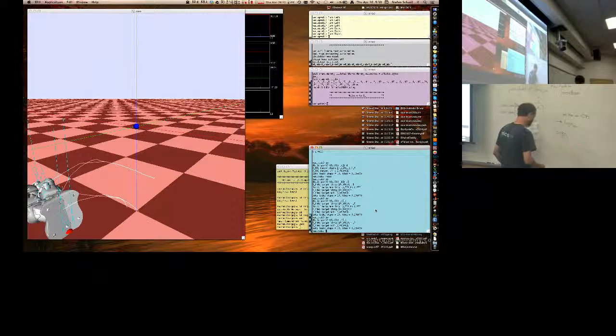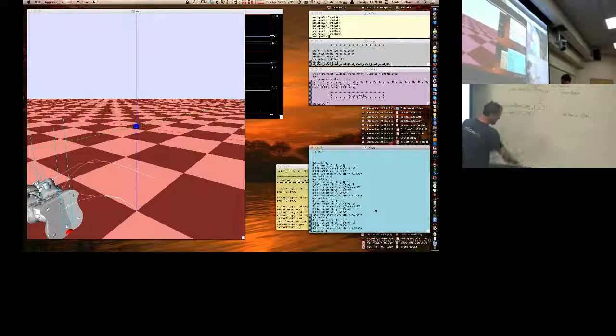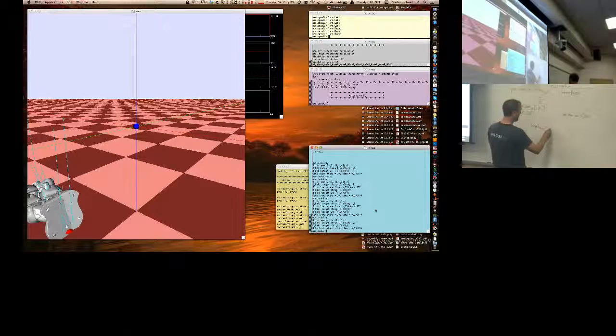It's a simple, smooth movement to do for all degrees. The nicer way, of course, is to do it with inverse kinematics. Now let's use the pins here. And if we do inverse kinematics, you need to look at homework 2, how the Simulink block was realized. So inverse kinematics means that you have as a control variable the target of the COM, the target of the center of mass, that's your desired, minus your current position of the center of mass. So this is the difference, and you want to basically make the system move over there. So you can think of that as an x dot desired. You can put a little gain in front of it to scale it down.